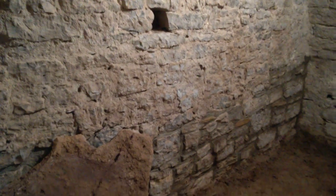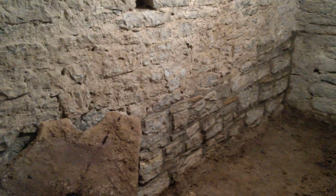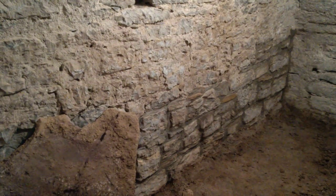Last night I finished off on the left-hand side. We decided basically to plaster the top half with lime-based plaster, so it's really breathable and natural. The bottom part we just tagged out the old mortar and repointed that yesterday, so there's a nice contrast there.